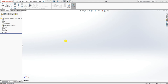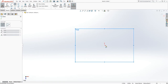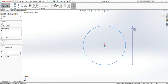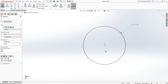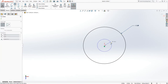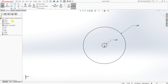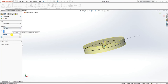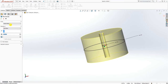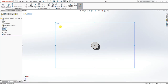Hello guys, so now we are making the next part in the wrench assembly. To start, click on the top plane, click sketch, draw a circle and add the dimension to it — make the dimension 0.590. Draw another circle in the middle and make the dimension of that 0.07. Now go to your features and extrude it by the mid plane at 0.375 and click OK.